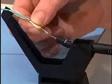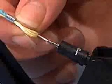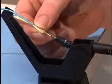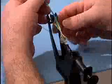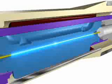Remove the rear dust cap from the connector body. Carefully insert the bare fiber into the connector stem until you feel the fiber make contact. The final position of the jacket edge should be less than 2 millimeters from the stem. Do not disturb the fiber after it has been inserted. Secure the cord in the clamp, allowing a slight bow in the cord. This will maintain contact between the end faces of the fibers.